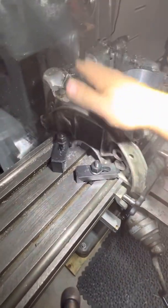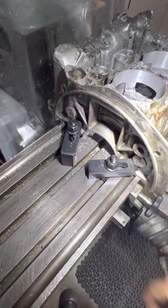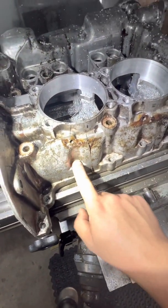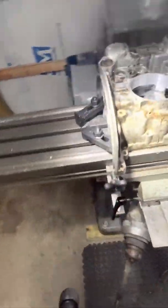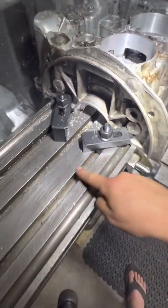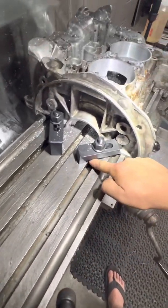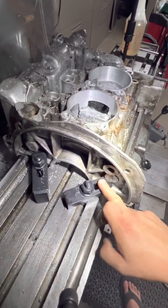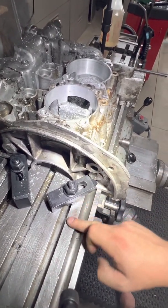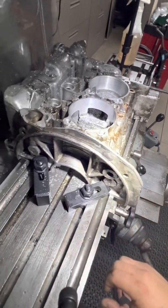When I bolt the case down, I'm bolting it down over top of existing bolt holes, much like these. It gives a nice rigid spot to pull down. One thing I want to stress is when you're doing that, make sure you're not over a T-slot. You don't want to be over a T-slot because you're going to be trying to bend it, and these being cast aluminum, they are actually somewhat delicate. But if you put it over top of a nice solid piece of material, it'll pull down and pinch it nice and rigid.